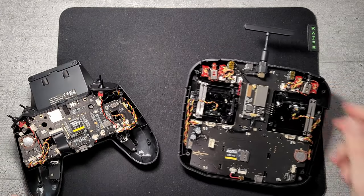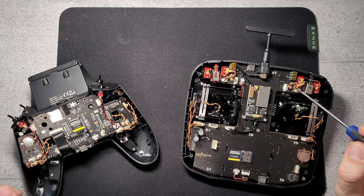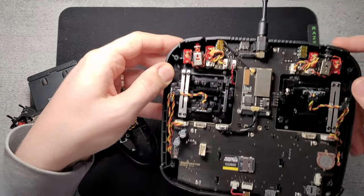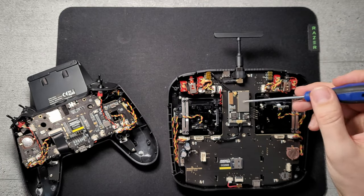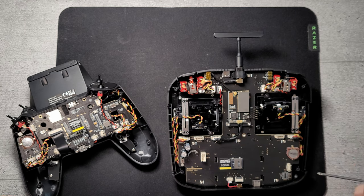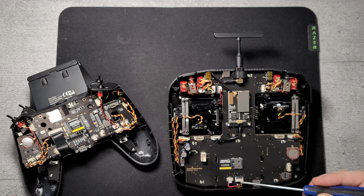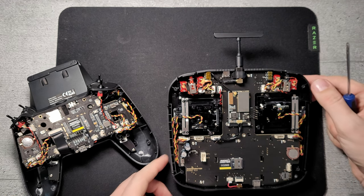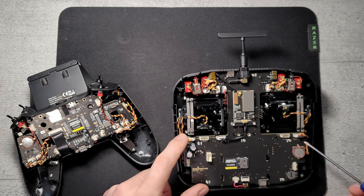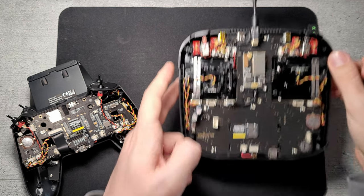Inside the Boxer there's not much to see. The two-position switches unfortunately have only two wires, meaning you cannot put a three-position switch in those slots — you're stuck with basic two-position switches. You've got your RF module depending on your version, the V4 gimbals with most adjustments on the front, clock battery, SD card (which you should really change), and screen connector. It's quite easy to upgrade the V4 gimbals to the better AG01 gimbals, and there's also an LED port if you want to add a light ring near the gimbals.